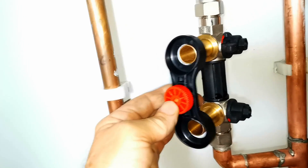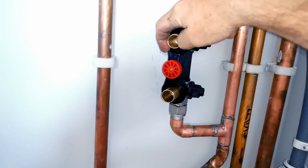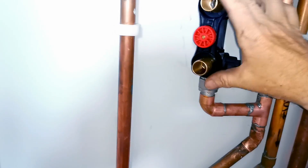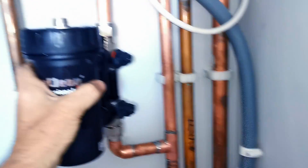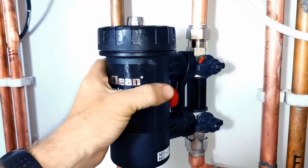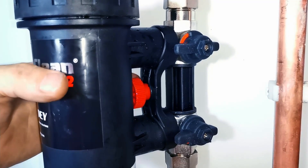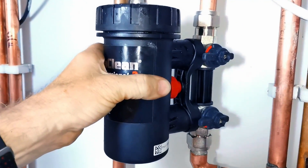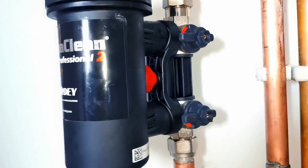To refit the pot, just refit the trigger onto the two valves. Make sure the valve tails are nice and clean, and I always like to put a bit of silicone lubricant onto these two tails — that will help the two o-rings make a good seal so we don't get any leaks. Carefully push the MagnaClean all the way back onto the two valves until it stops, then give it a good tug to make sure it is firmly on there and the two retaining clips are in the correct position. Then turn the red knurled screw anti-clockwise, which will push the trigger back away from the two release clips. Give it a good tug again to make sure it's not going to burst off when we open the valves and let the pressure back in.